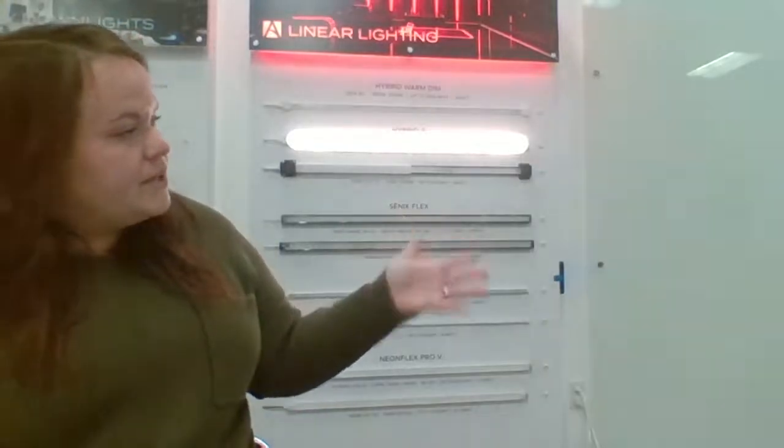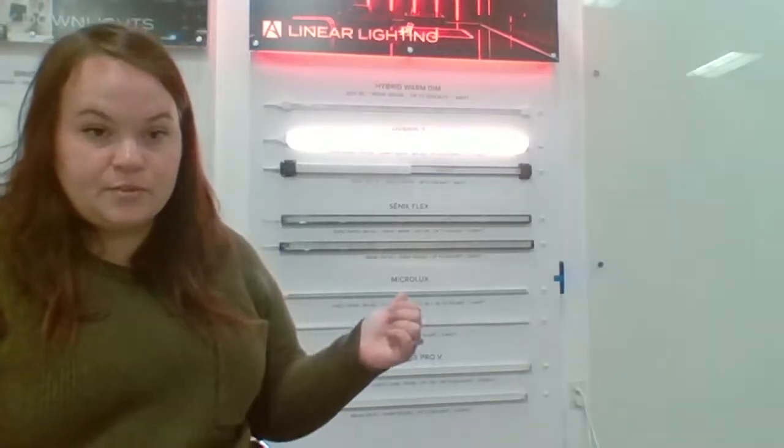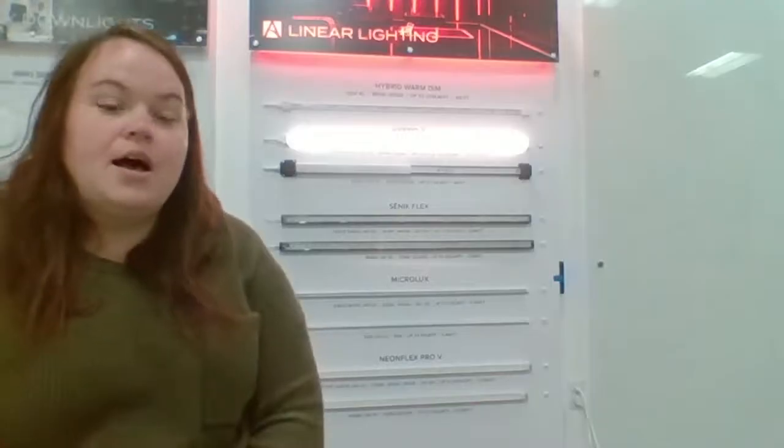And I'm going to take you back to the commercial grade light string that I was previously talking about. It's line voltage. There's no field modification. Field modifying a line voltage fixture would take away your warranty, would take away any third-party listings, ETL, UL, TUV, what have you. You can't field modify a line voltage fixture. So that's why we offer this in a 150-foot bulk reel, or we will custom cut it for you here in Denver, because we are an ETL factory, of course.